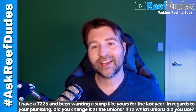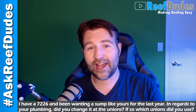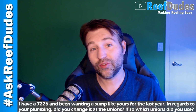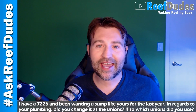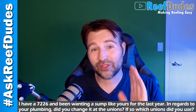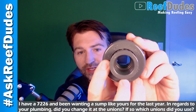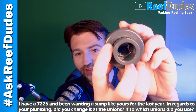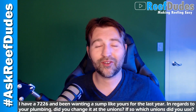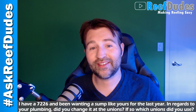Now for what size you need, on my tank it was 40 millimeter to 1 1/4 inches, and the drain was 32 to 1 inches. Now each model of tank, or even later in the production run, it's possible they could change the sizing, so double check your plumbing. To find out, if you look on your plumbing, there's usually a little stamp somewhere on it, so that one's 3/4 inch. Same thing on mine. On the little edge of those little couplers or the 90s, I was able to read the 40 or the 32 mil. That lets me know what size to get.